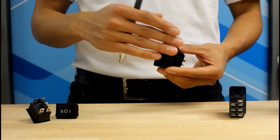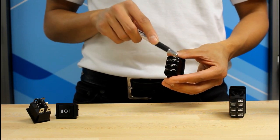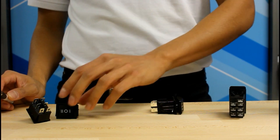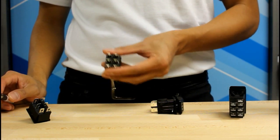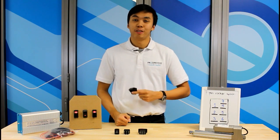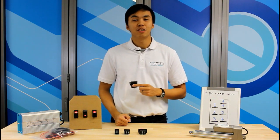On the bottom of our switch you will see 7 pins. The pin labeled as pin 7 is for the LED. On a switch without LEDs, such as the RC1 or RC3, you only have 6 pins. Right now the switch is in the neutral position, which means that none of the pins are connected together.